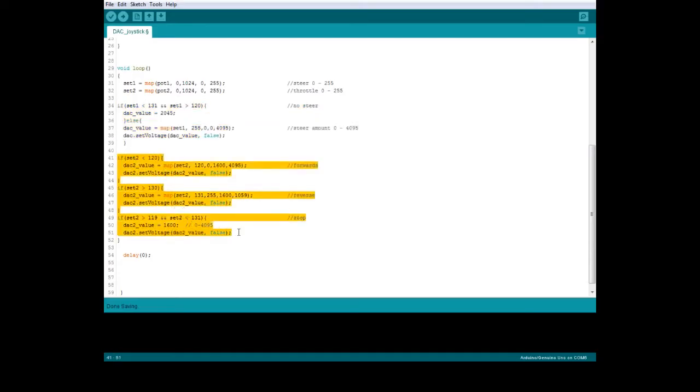This section handles forwards, backwards, and stop. Instead of going from 0 to 255 continuously, we've split it: 0 to 120, and then 131 to 255. The gap between 120 and 131 is zero throttle — when the throttle stick is in the middle, it's stopped. The minimum value is set to 1059; if you go any lower than that it makes the wheels stop completely, so bear that in mind if you want to change these values.